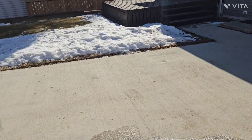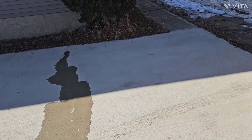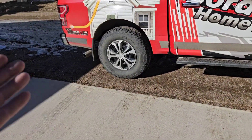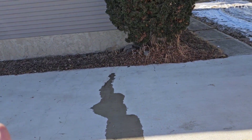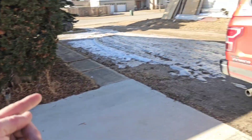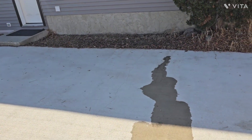If you're putting in a pad, think about these things — they are preventable. In this case, if they couldn't prevent the slope because they needed to match the sidewalk grade, they could have put a curb on it. That would have held the water back and eventually let it run out the end. They didn't do that.